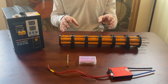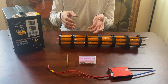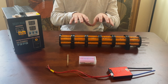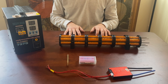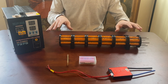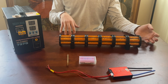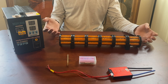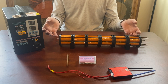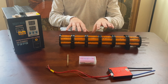Basically, instead of building the aircraft and inserting a battery, you're building the battery and then attaching the things that make it able to fly, such as the wings and the motor. What that would look like specifically for this battery in terms of further development would be to extend the length of these threaded rods that hold it all together, and then on one end you would attach the motor. On the other end you would put the electronics, and you would then install this whole tube system which houses the motor, electronics, and battery.